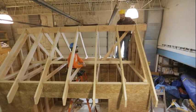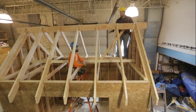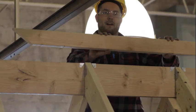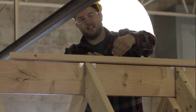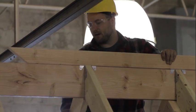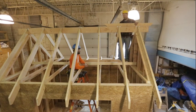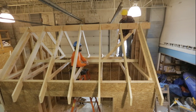One other important thing: the two-by-four running the length of the building — Azad put it on edge. A two-by-four is much stronger on its edge; there's not as much deflection. If you put it flat, it could deflect over time when the brace comes down into it. He has it on edge, laid out with the same layout we used on the exterior wall, and we've secured each ceiling joist into place.